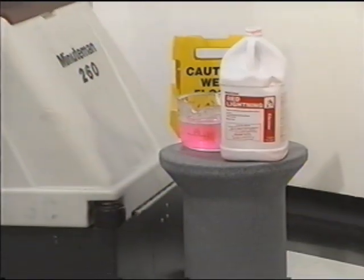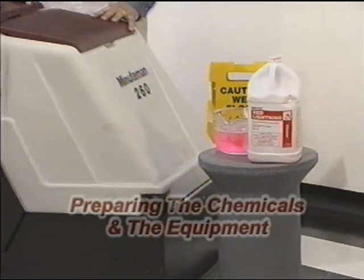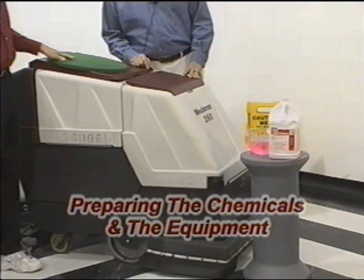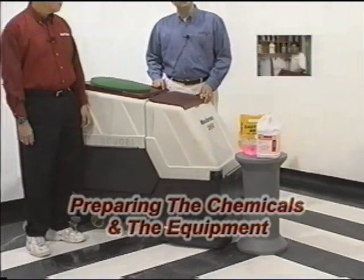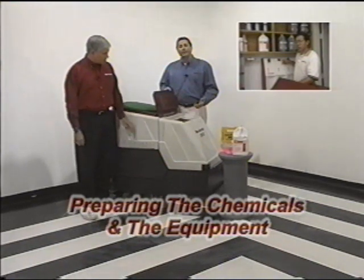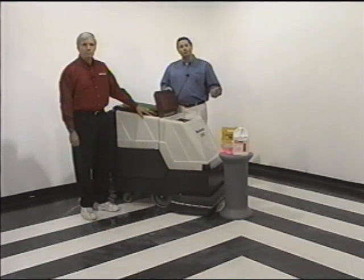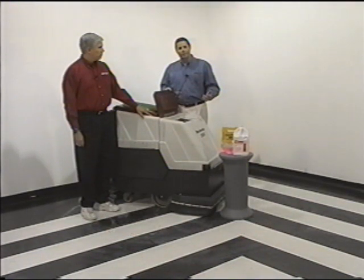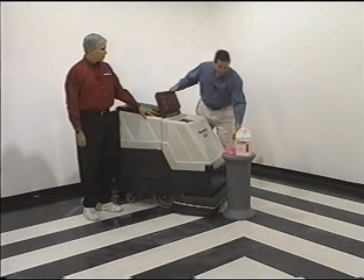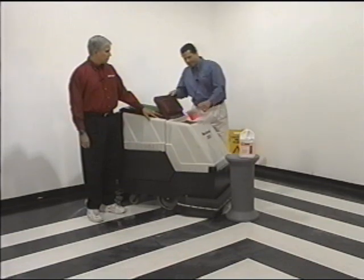The best method of scrubbing prior to recoating the floor is using an auto scrubber equipped with green or blue scrub pads. And if you have a multi-clean dilution control center, you use product number 6 and fill up your clean water tank. If you don't have that system, we also have Century Maintenance Neutral Cleaner, Blue Blazes, or Red Lightning to choose from. Today we're going to use Red Lightning diluted at 4 ounces per gallon.